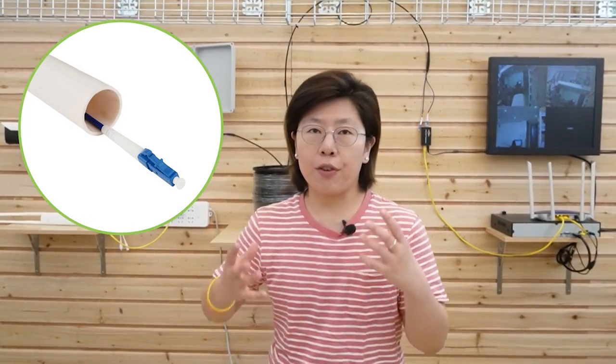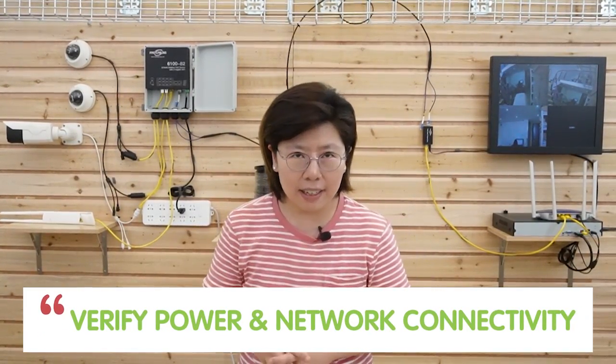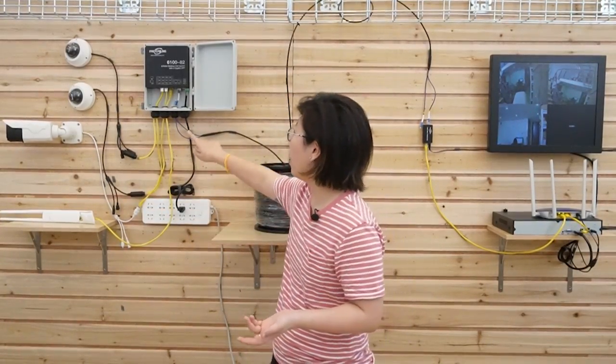Here are a few more tips. If you're pulling a fiber optic cable, make sure you use a pulling eye at the beginning of your installation, and pull your fiber optic cable through a conduit if you need to bury it underground — since fiber is made of glass, it's a little fragile. You should also verify your power and network connectivity, and make sure your device is working and cable connections are plugged in tight. If you have no AC adapter or power source available at the installation site, you can watch the linked video on how to use fiber optic cable in an outdoor deployment. Thank you so much for watching, and I'll see you next time.